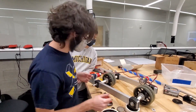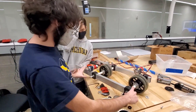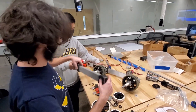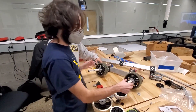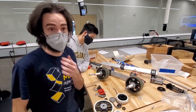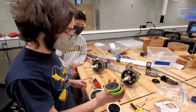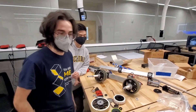After some initial testing it looks like we're not shooting the ball high enough. We boiled it down to basically the compression ratio — how much we're compressing the ball — and also how much mass is on our shooters. I'm going to try to increase the mass on the shooters by adding a third wheel, and also add these smaller wheels and whatever else I can find.